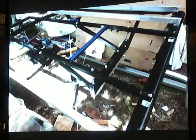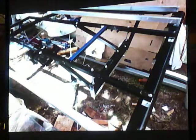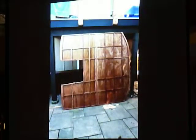Yeah, I was going to weld it, but all the aluminum's anodized, and you can't weld it without grinding, so it's much easier just to bolt it. And the other thing from a maintenance standpoint is you probably need to bolt it, because if you use a lock nut or Loctite, it's not going to come undone. Exactly. You damage a stringer, you can take it apart. Exactly, yeah, so I used my lock nuts.